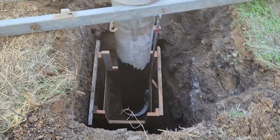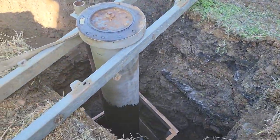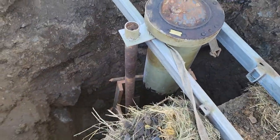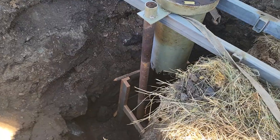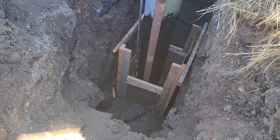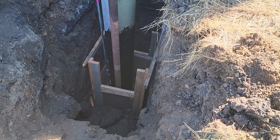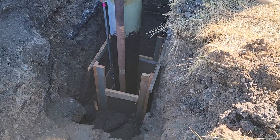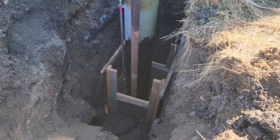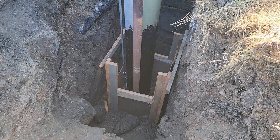I'll fill back around this thing with probably most of that dirt there. I'll get a good amount of concrete in the base of it. The bottom of that is about two feet high — it's more of a rectangular shape, 30 by 24, and it's two foot high. I'll probably make it a little bit higher. You can see where I've got the two by four extended up.